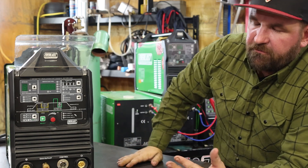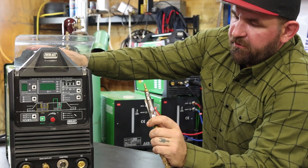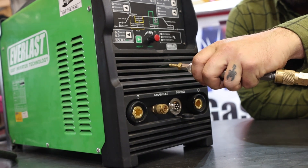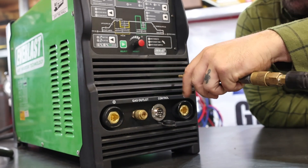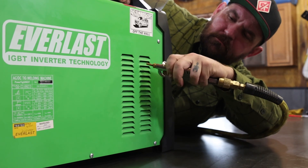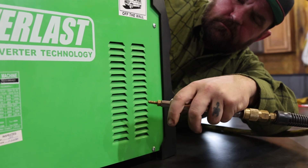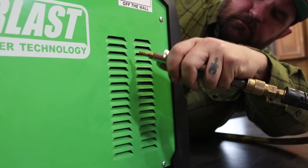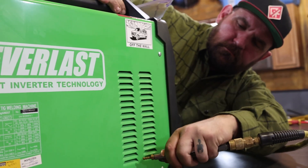At the end of every week — like Friday or Saturday — I'll come out to the shop with my air nozzle, machine off. I don't always take everything off the front. I'll blow out the front of the machine and blow out the side aiming towards the back, because the intake fan is on the back. The highest concentration of dust and grime is on the back of the machine, and ideally I don't want to blow as much dust as possible through the machine first, so I always blow front to back.